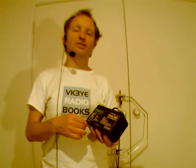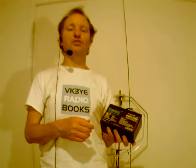Your 100-watt transceiver might draw something like 20 amps at 100 watts. But down at 10 watts, it might still be drawing, I don't know, 8 or 10 amps, something like that. It is horrendously inefficient as a QRP transceiver. Maybe it doesn't matter if you're just doing QRP from home, but if you're portable, then that's something to consider. Something like the FT817 draws nearer to 2 amps on transmit with 5 watts, and that's more efficient.